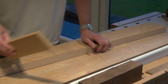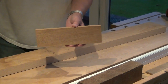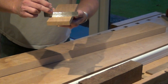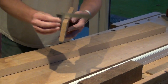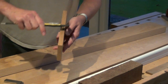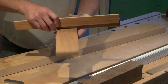What we're aiming to get is a component like this one. Obviously we'd hope to harvest something a little larger from that long board, but what I mean is this is lovely and flat, absolutely no cup in there. The edges are perfectly square to the faces, exactly the same thickness throughout, and with no twist in it.